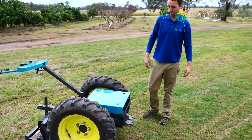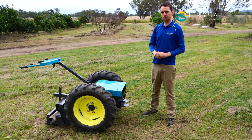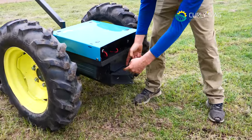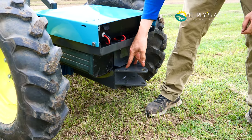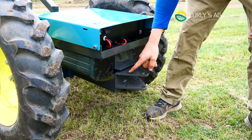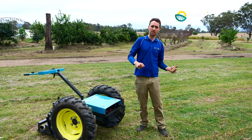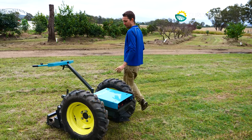More features — we've got the hitch, our very own design. You put your implement in here, put your 20mm pin through the centre, and then you lock the horizontal movement so it doesn't twist, or you can leave it open. For a trailer at high speeds, we always recommend using the outside pin position, which gives approximately 10 degrees of movement — a little bit of steering, but if you accidentally go far left it's not going to throw you off.